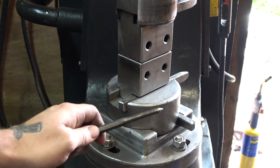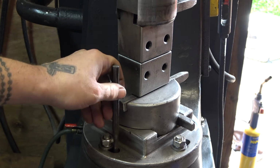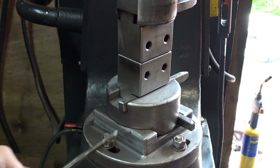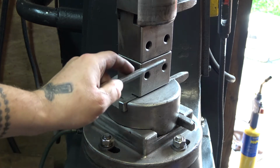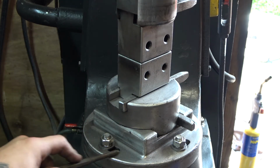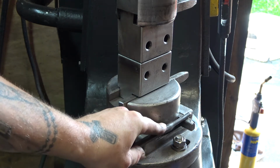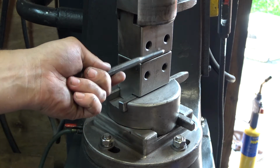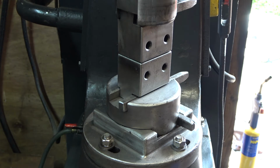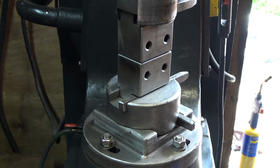Basically what it is, you've got a bottom plate with notches in the bolt holes, so you can twist this round into the correct position. You've also got this part that you can move forward and backwards to line it up forward and backwards. This one obviously does your left and right. And then you've got your tapered, hardened pins to hold it in at the bottom here. Also, this ram does not disappear back up into the cylinder like they used to do on the older Anyang models. It is now hanging down, so it's easier to change your dies.